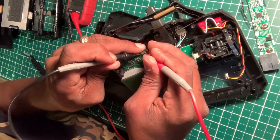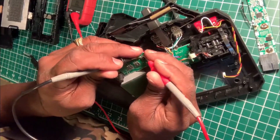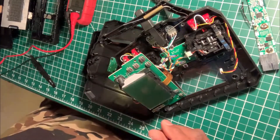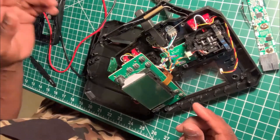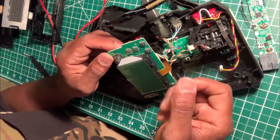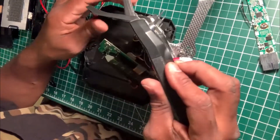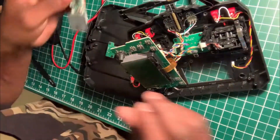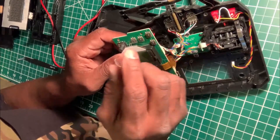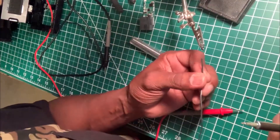We're going to push the button - I need to put it on continuity. We want it so that when we push the button it triggers the switch right there - that's all we need. You can buy these on Amazon or any electronic supply house online. They have to be momentary switches. You can even get a toggle-style switch but it has to be momentary - when you push it, it snaps right back. You don't want it to stay on. We're going to pull one of these off and mount it on the case.